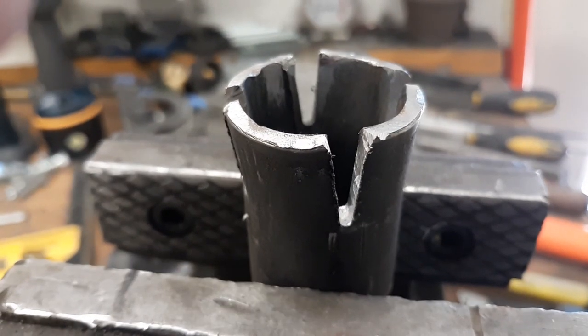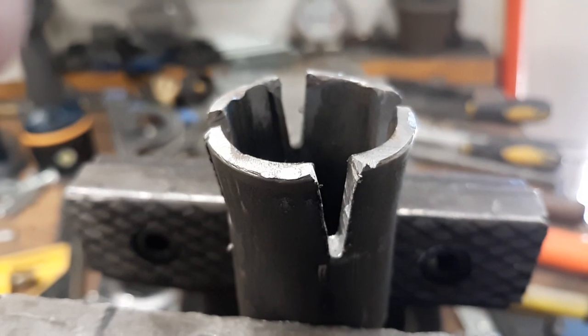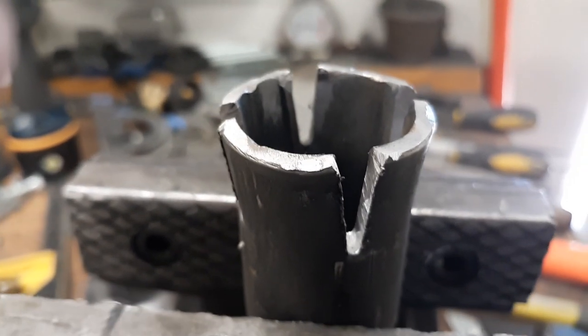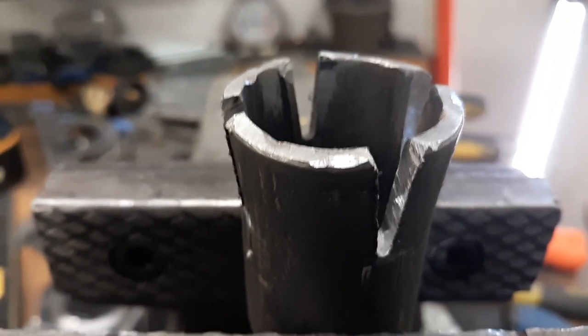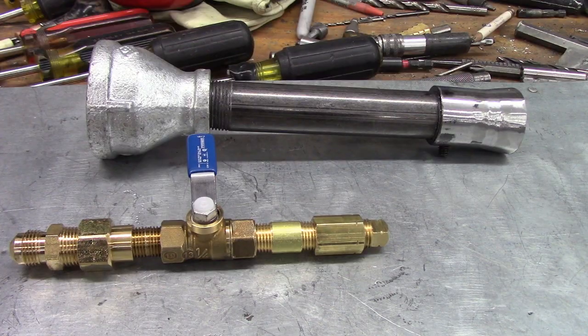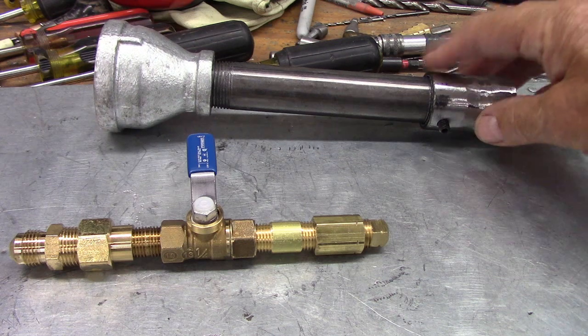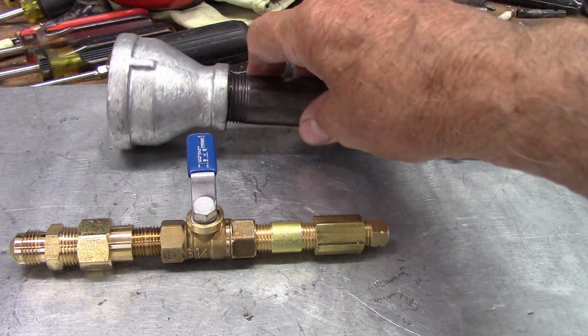There it is flared. I haven't welded it yet, but the drift didn't work all that well, so I used the large ball peen - the ball end of it - to force this apart, and it worked really well. So we'll weld that up and make a flare. This is the burner temporarily assembled. This is the flare that I just built for the end of it out of a piece of one-inch. It's that screw that holds it on to the three-quarter pipe.